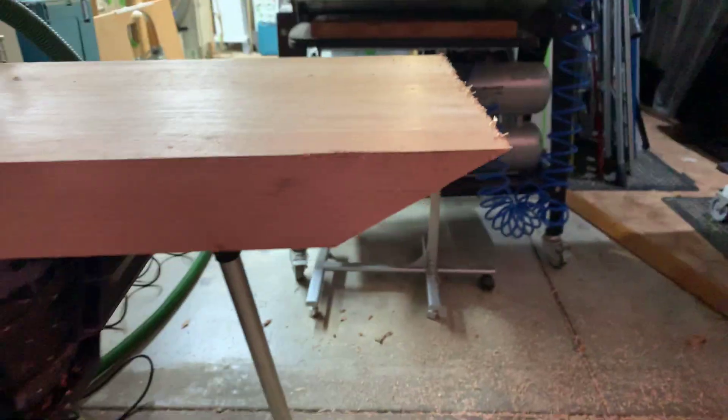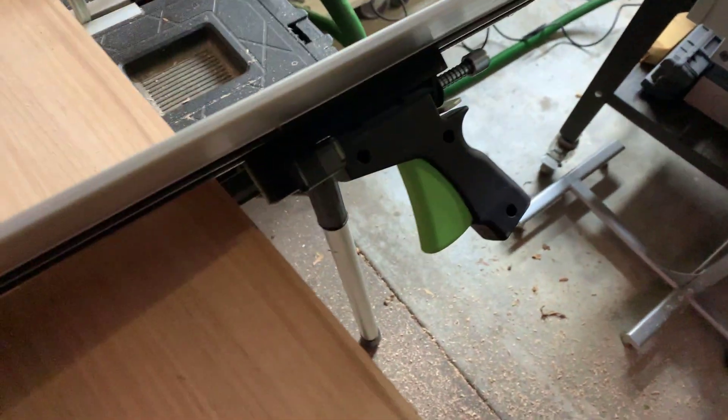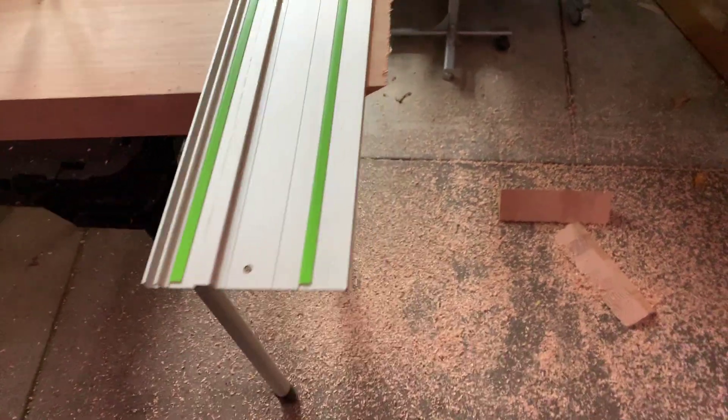So here's the saw. Here is the edge — this is where I used the rail. I've cut a 60-degree angle, as you can sort of see. This is with the hose on. Look at the mess everywhere — that's with the hose. You really have to have these because when you cut on the angle they get in the way. The good thing about this pistol grip is you can spin it around when you've got it locked down, to keep it out of the way of the blade when it's cutting.